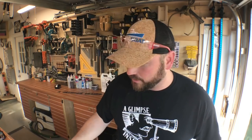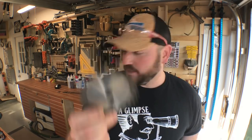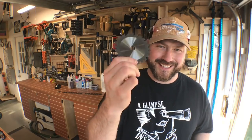All right, so did you see what happened there? I ruined the blade. My efforts to clean this thing up — I absolutely ruined the blade. So when I was trying to cut that piece of wood, I couldn't cut the laminated wood. I then plowed through a piece of half inch plywood and made it through, but this blade — the teeth actually offset each tooth, they go back and forth very minutely, and in sanding I messed that up. But we live in a time of Amazon and these exist — a half inch arbor, a four inch blade. Let's put it back in and test it out.